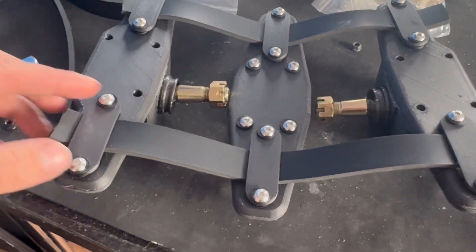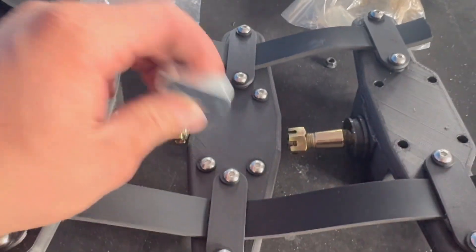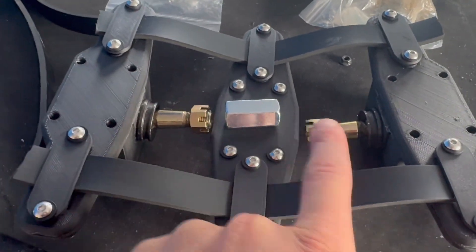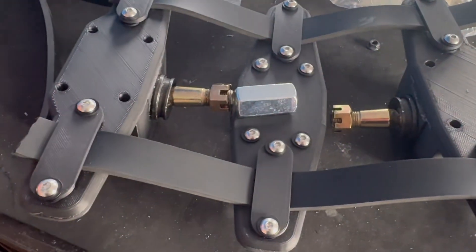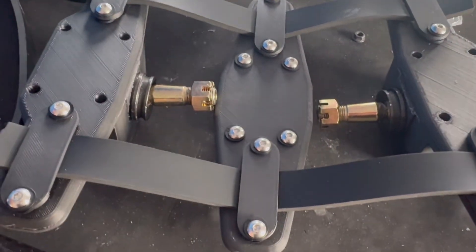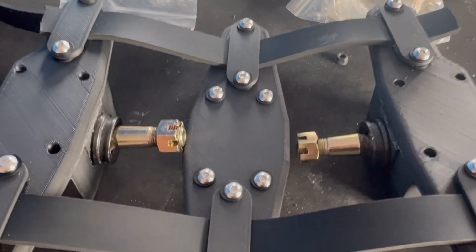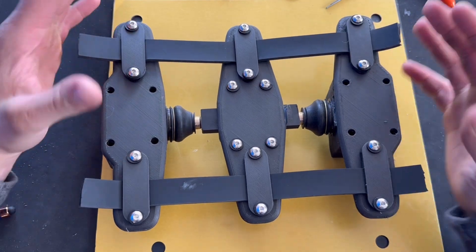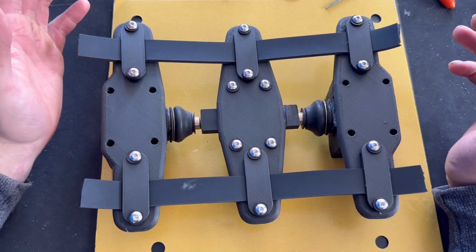Two mistakes I've made for this video: the bolts aren't long enough so I can't wrap the elastic around twice — I'll correct that in a future video. Also the threaded hex sleeves I bought are coarse thread as they normally are, but the ball joints are fine thread, which I should have known. In the meantime I'm going to 3D print a sleeve and order proper ones. I can at least get the boots mounted onto the ball joints and get it all sealed up. It is now all assembled together — note this is severely under-tensioned on the elastic, but if tensioned correctly for the armor it won't be usable for trialing in this video.